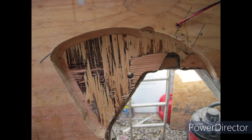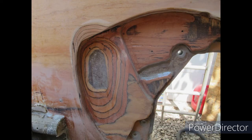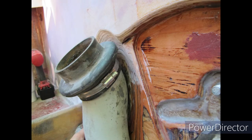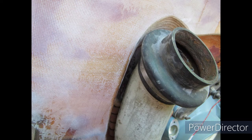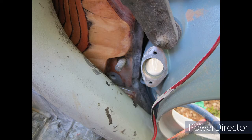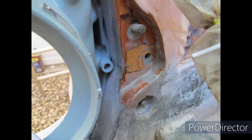Coming to the inside of the transom — this is above the transom plate, and that's where the steering arm has to swing. I had to cut all that out and mock all that up, and it looks like it took about 10 minutes but that actually took months off and on. Here's the exhaust there for the turbo — the water comes out of the turbo and the exhaust goes down and out through the transom plate. That's all custom, and that transom is really important because it holds up half the boat motor, since the front of the boat motor is the only part with engine mounts.